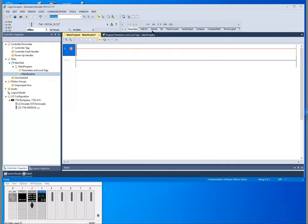Let's start with our simple sealing circuit and then we're going to add to that. We have two normally closed e-stops, so we're just going to do the local e-stop first. Since it's normally closed, we're going to use an XIC here, because with that switch being closed it'll energize this whenever it's not pressed. Your start button is also normally open, so we're also going to use an XIC for our start.